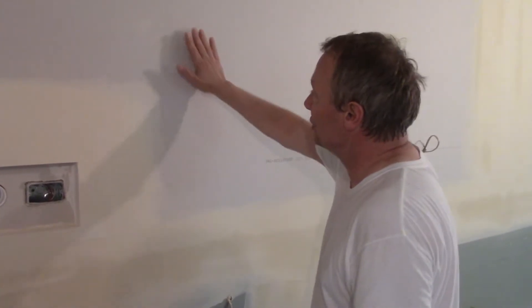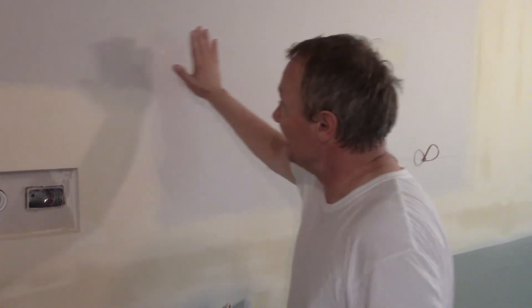And yes it can — it really can. If you do not push the drywall into the glue when you're gluing it, and you just kind of touch the glue so it just barely sticks to the drywall, there's still a gap between the drywall and the stud. If you haven't smashed it together, the glue can actually shrink up after you put the screw in and create a screw pop. That can happen.